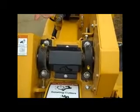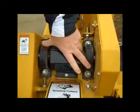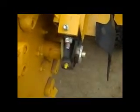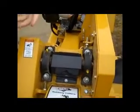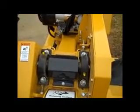Also on daily inspection of your machine, at the end of the day you'll want to grease your bearings — the jack shaft bearings, the cutter wheel bearings, and any other bearings and grease inserts that may need to be done on a daily basis. You'll want to do this at the end of the day so that when the bearings are warm, you can put grease in there and as the machine cools, condensation will not rust the surface of the bearings or the shaft.